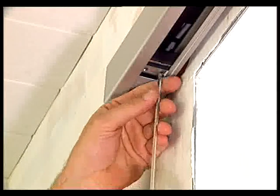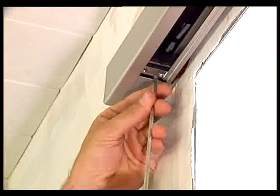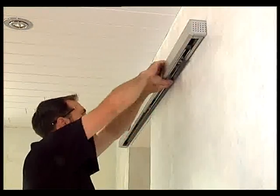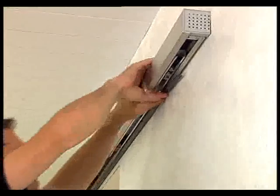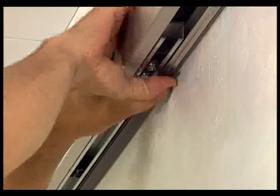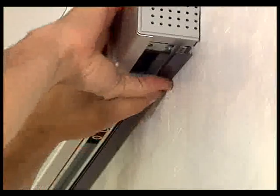Move the end stop on the side of the control unit to the end of the track rail and fix it loosely. Make sure it does not project the rail. The enclosed black wall connection profiles are fixed below the operator. The last profile has to be cut to length.